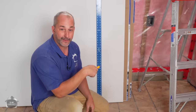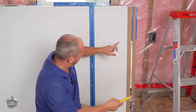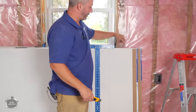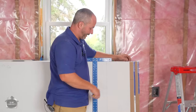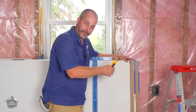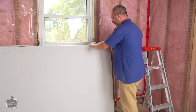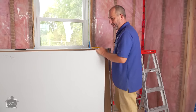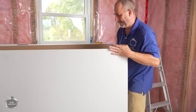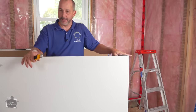So this one blade is gonna do all the drywall in this whole room, because what you're doing is you're cutting the paper. Remember, drywall is paper with all the compressed gypsum in between the two layers. As long as you can cut the paper, you'll break the board, no problem. Now, the way you break this after you put the score is just, that's it, a little bit of a wiggle, all right? Nothing to it. Now, if you fold the drywall back like this, you got control of it. It's not gonna fall over.